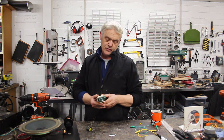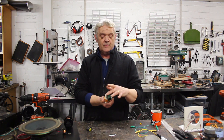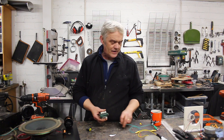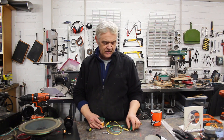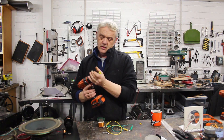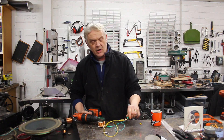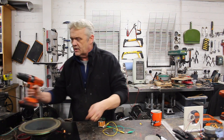Hi, I'm sure quite a few people will recognise this — it is actually a Manchester dynamo, one of the earliest forms of dynamos. We put a permanent magnet in there and spin it; because we've got two coils on this armature, we get a rotating magnetic field going north-south, north-south. This thing will generate a considerable amount of power, and all I'm going to do is light up an LED. So we connect our LED to that. There is our magnet — magnetised north-south along those edges. We pop that in a drill and sure enough we'll be able to get that to light. No problem at all.